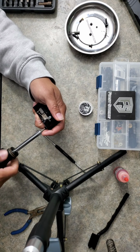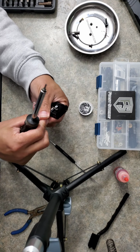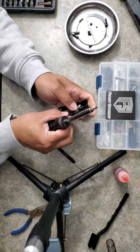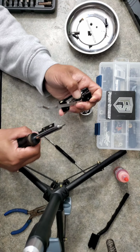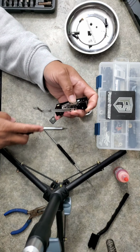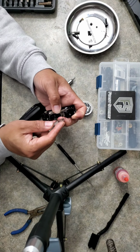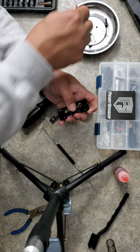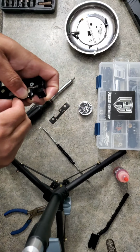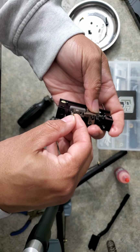Of course, I have accumulated extra springs because I find that when I disassemble these things, sometimes I need them. So I stocked up a little bit. They're cheap enough. So I'm going to hold that, take that loose, remove the rotator spring. I'm going to take the trigger arm along with trigger spring off. And here is the first modification I've done. I just removed the sear spring.